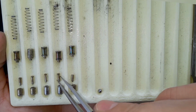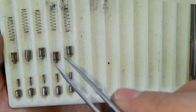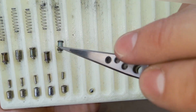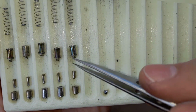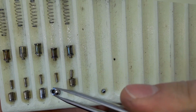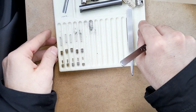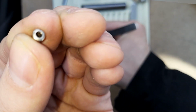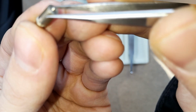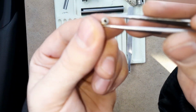For the insides of these pins, the inner pins, the key pins are all the same except this one in the last position. And in the inner pins on the drivers, you can see that there is a tiny bit here that catches on the over milling, which is inside all of the standard outer driver pins. I'm not sure if you can see it, but there is over milling, and this over milling catches the inner pin and locks up. So that's a very clever design, very interesting.